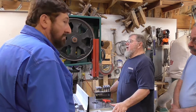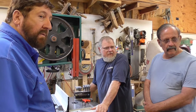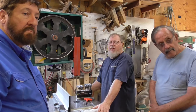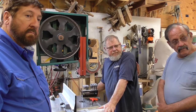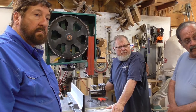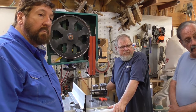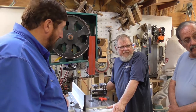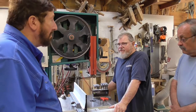So I know on some of the log cutting bandsaws, the tension on those blades is 5,000 to 7,000 pounds. Yeah, they're extremely tight. There's also a flutter test that a lot of people do. I don't do it, but they say when you're setting up your bandsaw, you open up your guides, top and bottom, turn it on, and you tighten the tension until the blade quits fluttering, and it'll finally get still. And so I'm getting a little flutter. You can look at it here and see it doing that. Yeah, it'll flutter. I'll show you that in just a second.